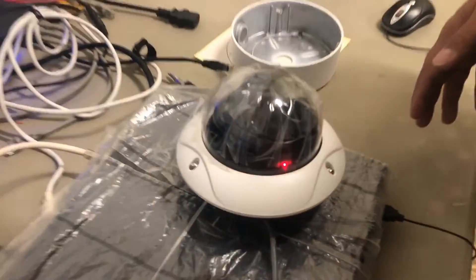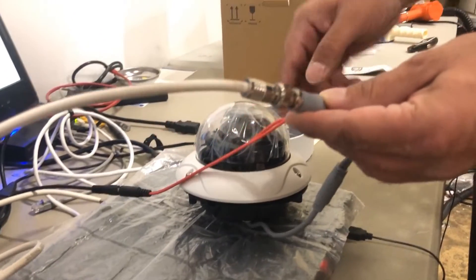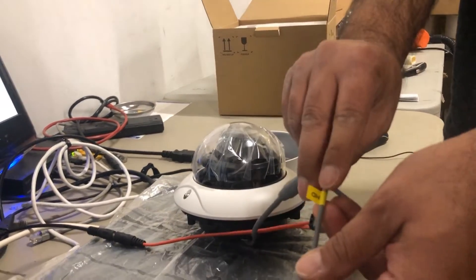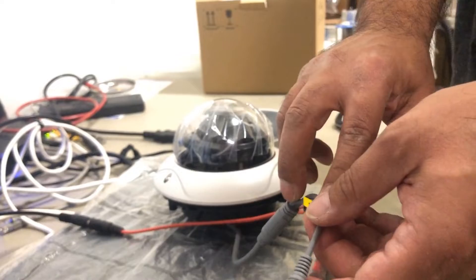Here's a video on how to use this camera. It's a dual voltage camera. We'll start with a pigtail — this is a BNC pigtail, which is what goes into your DVR. This is how all security cameras are. It can output both HD and analog, and I'm going to show you how to switch that in just one second. That's really what this video is about.